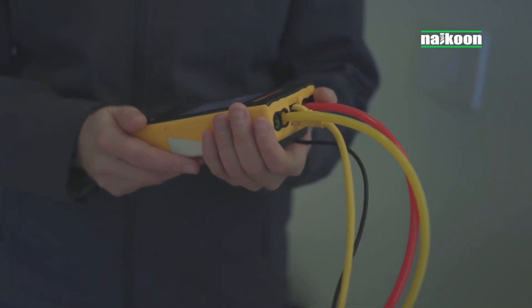My name is Emma Conway, I work with E3 Eco Group, and we're here today to do the final blower door test at the Radcliffe Passive House. First, we're going to do a depressurization test, followed by a pressurization test, and then we're going to use the average of the two for the Passive House air tightness. The numbers we're going to take today will tell us how airtight the home is. The Passive House standard is 0.6 air changes per hour, and we're hoping to get better than that today.